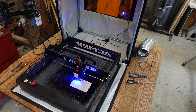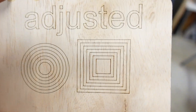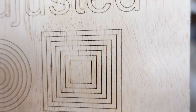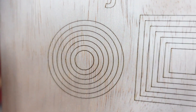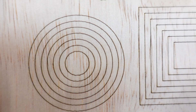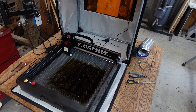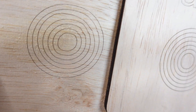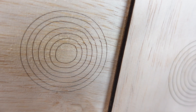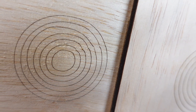The thing I'm looking for now is good clean lines that match up, evenly spaced and shaped the way they're supposed to. So here we are — there's my squares. Squares look good, I don't see any issues with the squares. And there's my circles — guys, I can't even tell where it started and where it stopped. You can see those lines are evenly spaced, circular in shape, and definitely more circular than when we started. So I'm going to show you side by side — when we started, that's what we were doing. That's one roller out of adjustment right there. The big one was that one roller that was really out of adjustment. So if you start seeing this with your machine, you need to check belt tension, the synchronizing bar with the timing connector that has the grub screws, as well as the rollers — just make sure those eccentric nuts are tightened the way they need to be.